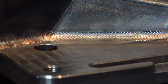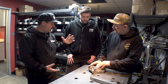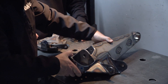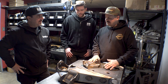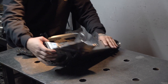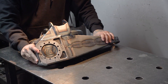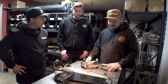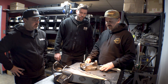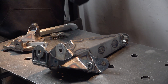So how does this compare to one of your longer uprights, your spindles for a pre-runner? There's one right there — that's basically the difference. That's all double passed as well. There's a lot more fitment involved with this one, and the steering arm is pretty intricate. This one was just the one machine piece that goes on and welds on. So do you still try to bounce around on different parts when welding? Yeah, exactly — I'll weld slots and then I'll do a weld on the bottom side over there, then run a pass on another, just kind of jump around a little bit.